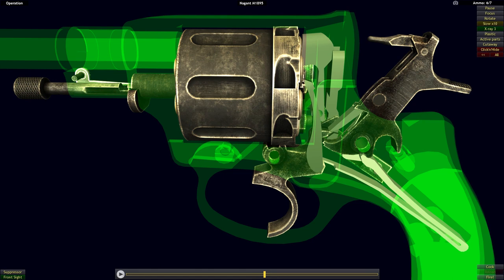These elements add a significant amount of weight to a double action trigger pull, and designing around that is going to be rather difficult. You'd have to come up with a completely different mechanism to drive a gas seal revolver if you're going to overcome this disadvantage. You could make the trigger return spring lighter, which would improve the double action trigger pull, but that's an improvement you could make on any traditional double action revolver — it doesn't give you more benefit in a gas seal revolver than in a traditionally designed one. A traditionally designed revolver is always going to have a better trigger pull, especially in double action mode. In single action mode you could get close to a traditionally designed revolver, but in double action mode you're definitely facing all these resistances and there's no real way to avoid it.